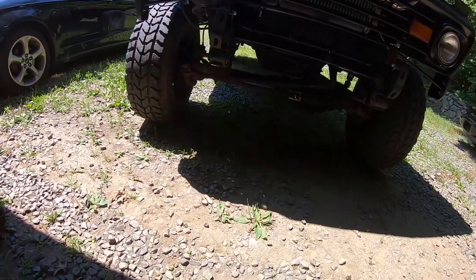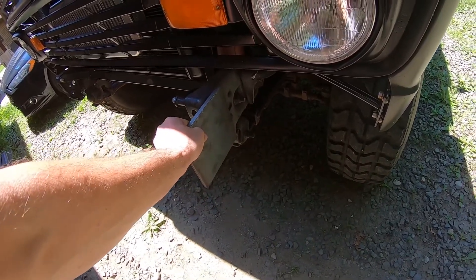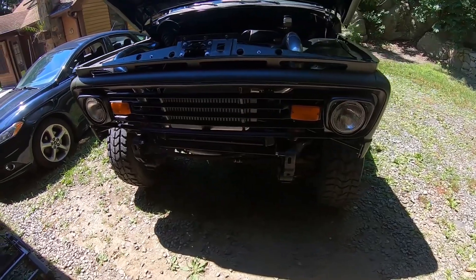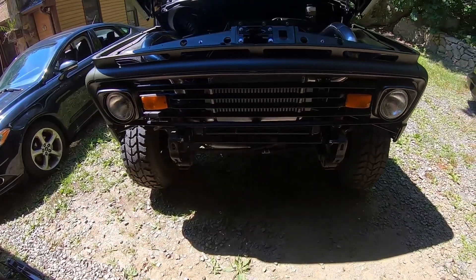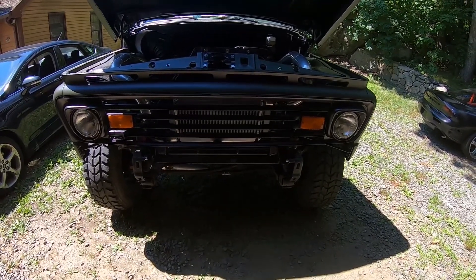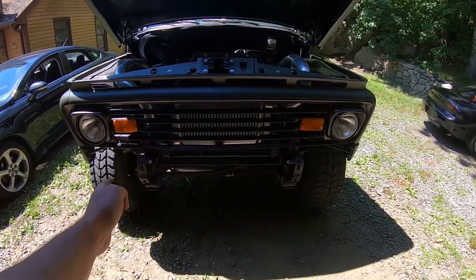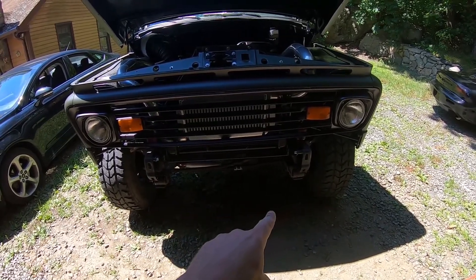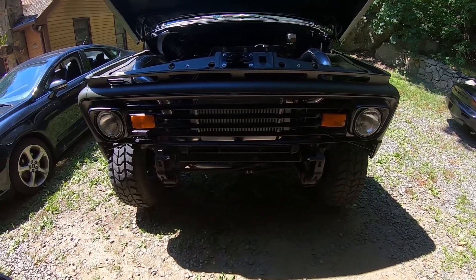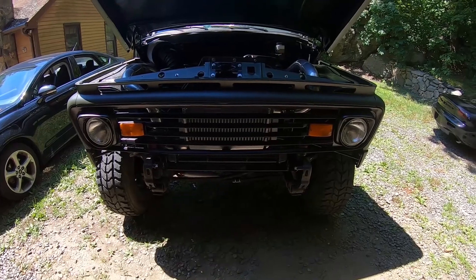Everything is based off the mounts. I want the mounts — these big 5/8 steel plates — to come straight out from the frame, and they're going to become shackle loops that go through the plate in the front of the bumper. So if you hook up to that, or if you tow this truck, the force goes directly through to the frame rather than through the plate steel bumper, which is really the best way to do this. The whole bumper is going to be 3/16 steel plate — pretty strong and pretty heavy — but to handle a direct impact I'm also going to put a piece of 2x4 rectangular tubing right between the frames, attached to the 5/8 steel plates. It's really all about making this thing as safe as possible since I've been driving it a lot.